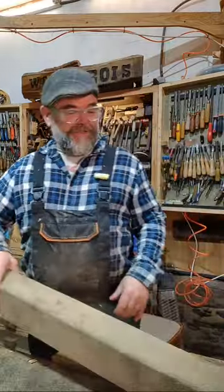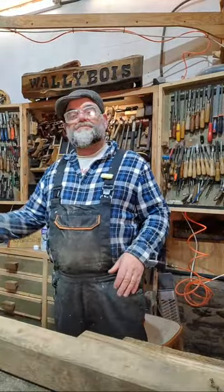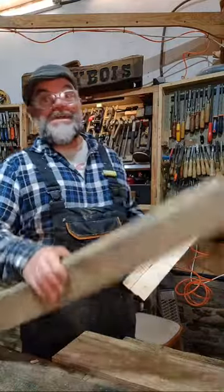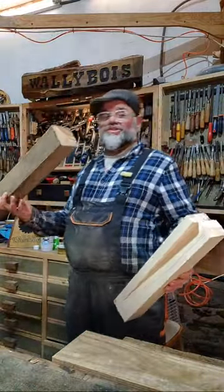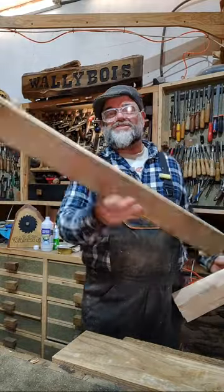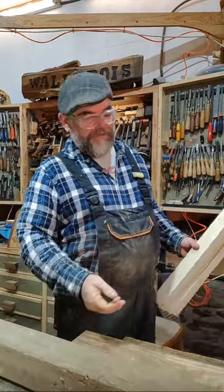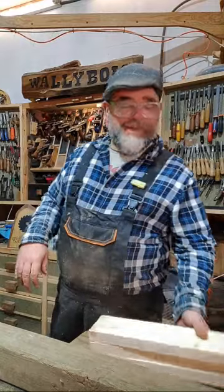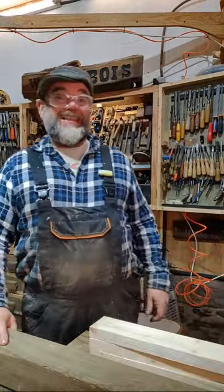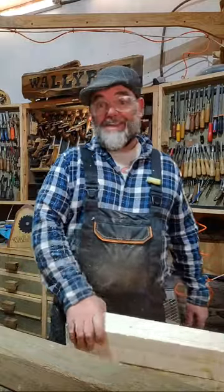So, what we're going to do is clean these bits of wood up first. And I'm going to have to joint the legs into this main beam here. I've got a bit of old pallet, about 3 inches square, or 75 millimetres square. A bit of old crappy pallet. We'll clean that up and hopefully make it look fairly decent as well. We'll put a tray in as well. They won't all be in this live stream because cutting the joints in, that's what takes the time. But first of all, we need to clean all the materials up.